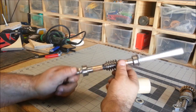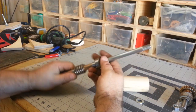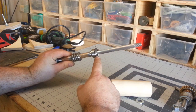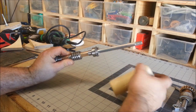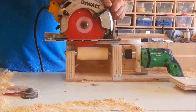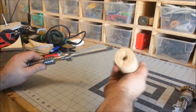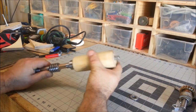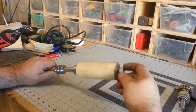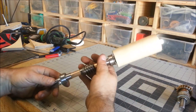I've got a couple of little bronze bushings on here as spacers so the housing will fit over the top of these. On this half-inch rod I got from the big-box store, I just drilled it out and ran a threaded 10-24 through there, and I cut this out on my lathe with a groove in the bottom. A little tap over the top and a bolt holds the spindle in place, so I'll be able to very easily change out spindles. I'll get some sandpaper wrapped around here later for the test.